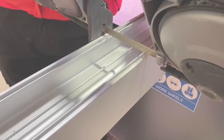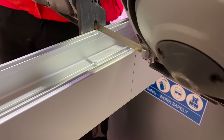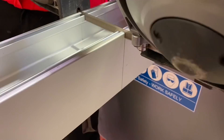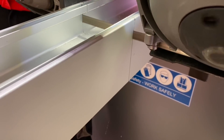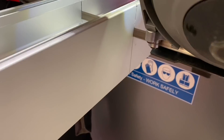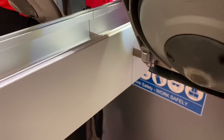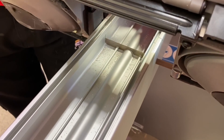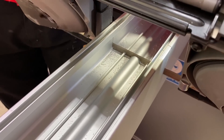A full length would be 3.6 metres. You can get a one-metre extension, and they will do special projects where they'll do a five-metre length. Atcor are pretty flexible on this — imagine you had a project with very high ceilings or required lots of the same length and didn't want to cut on site. This is the satin aluminium finish — that grey finish with the contrasting white PVC lid. You can also get it in powder-coated white if you wanted everything to be white.